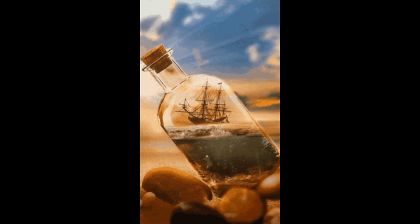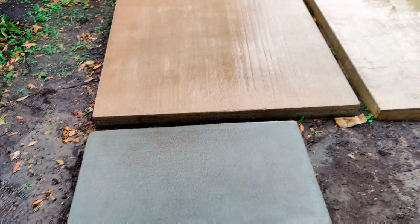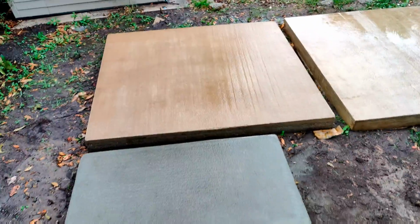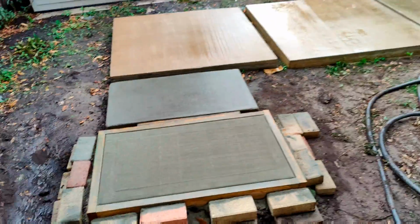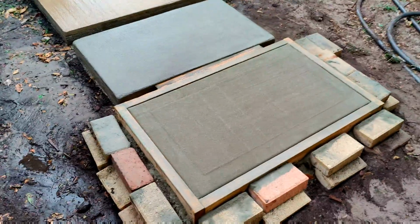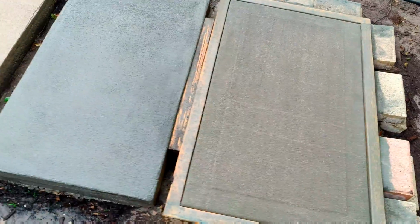He's saying that if the concrete mix is too wet in the beginning, it's going to be weak. He used an analogy of putting sand into a glass of water, where the sand just sinks to the bottom and makes it weak. I'm like, I got you. So he's like, the drier the concrete is, the stronger. Then after it's finished, you need to water it and continue to water cure it for the first 3 days. He said it hits like 40% of its strength. Then after 7 days, it hits another number, I forgot. Then you go all the way up to 28 days, 30 days,